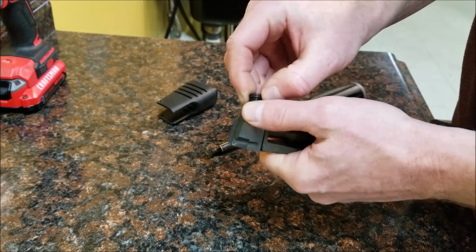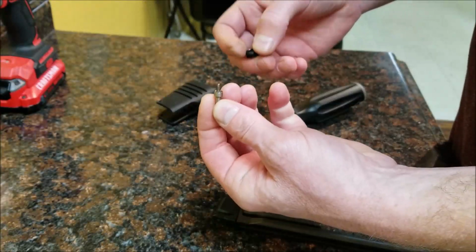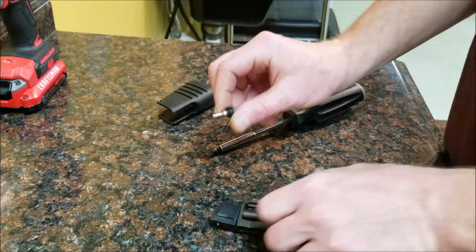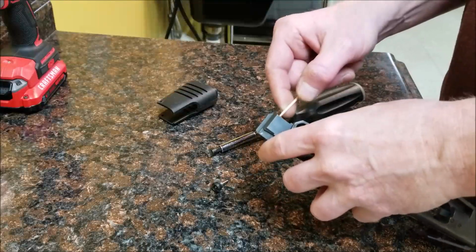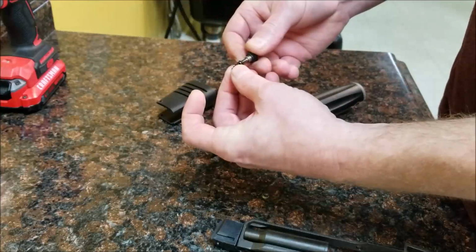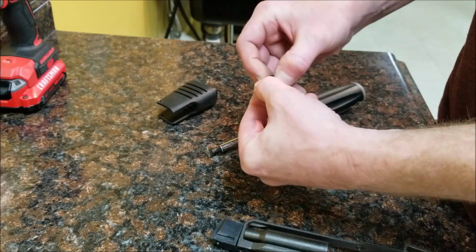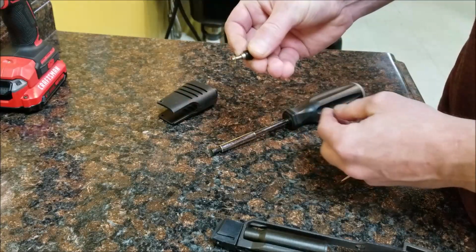Now this is your valve seat. This is your valve. And the way this works is you've got air in here and it's being, well, let me get the other seal out to show you. Okay. Now your spring goes on here like that. Let's just pretend our spring is on there. And then your spring presses on this metal washer that presses on this seal.